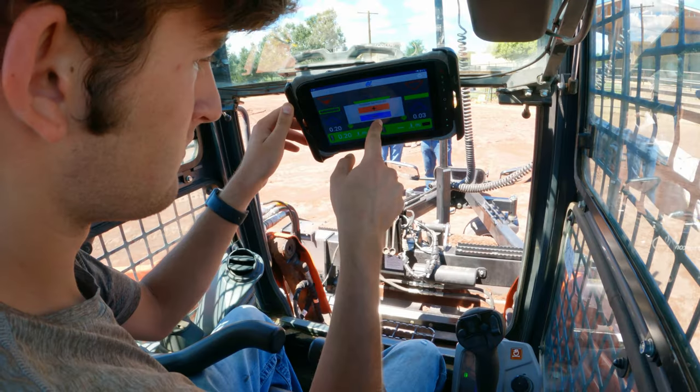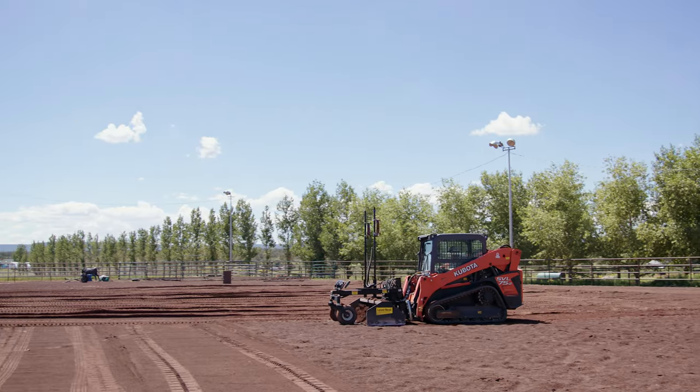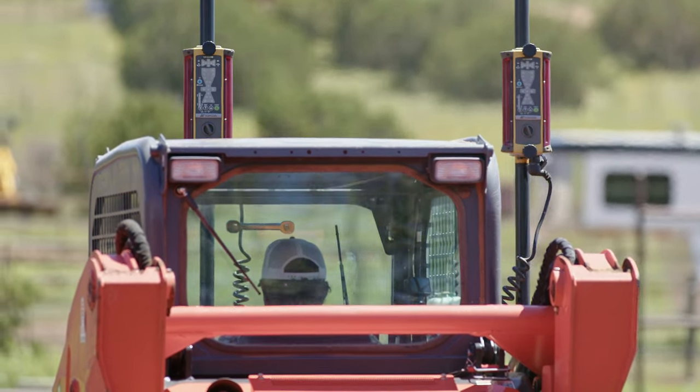That tablet — it's right there, easy to see. You have the model they want: the two percent slope, or a crowned road, or a super. You see your increments and decrements right there, where your grade is, if you need to bump it up a little bit. You just get it set up and go, you drive it.